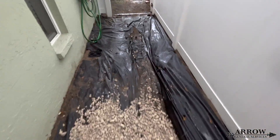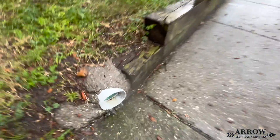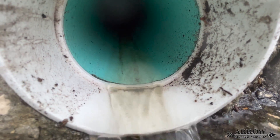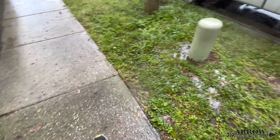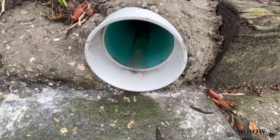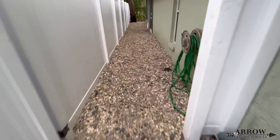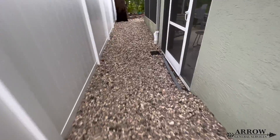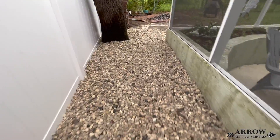While we were finishing this job it actually started raining on us, so you'll be able to see this system in action on a rain event. The straight pipe discharge allows all that water to flow out freely, and any debris present in the system is going to be easily flushed out. A straight pipe discharge is always best compared to using a pop-up emitter because it has nothing there to impede the flow of water — the water can just flow freely out.